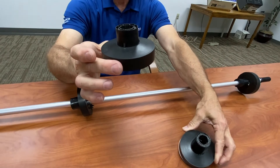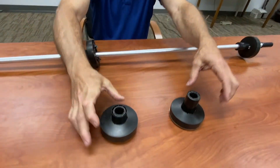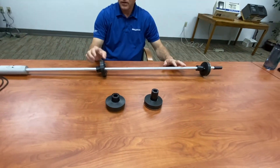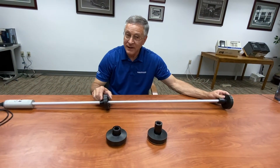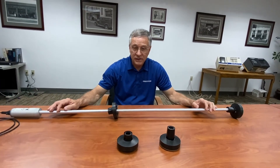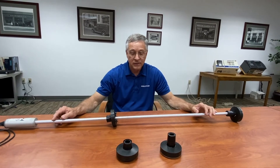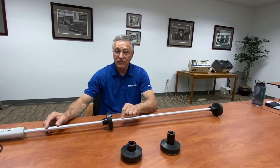The fuel float is made to float on any liquid. The fuel float and the water float are in this order: the fuel floats at the top, and the water floats at the bottom because water drops to the bottom of the tank. Also inside this shaft, we have five thermistors, which are thermometers, and it measures the temperature inside of the fuel.